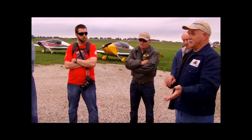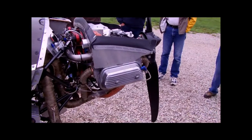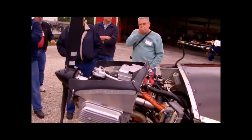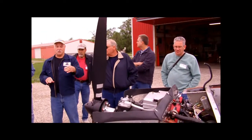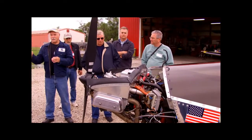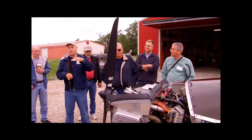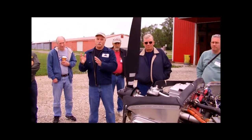The main thing you've got to watch out for is cylinder head temperature. Fuel flow with the turbo has a big effect on cylinder head temperature — not so much when it was normally aspirated, for some reason. If you see the cylinder head climbing north of 400, that's a concern. On a normal flight with 60-degree weather, the cylinder head temp won't go above 370 — especially number 3. I've noticed that if you land somewhere, do a touch and go, or start to taxi, and the cylinder head temp goes up, it will take you 30 minutes of flying to get that temperature back down. There just doesn't seem to be enough airflow through it. If it's cool to start with, it will stay cool.